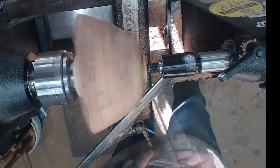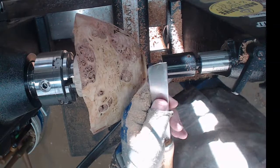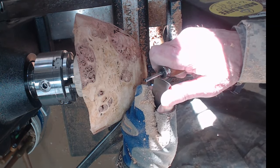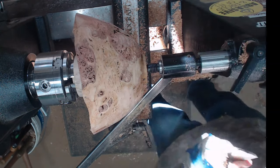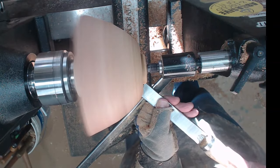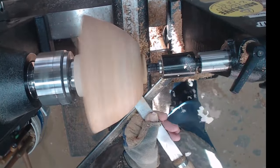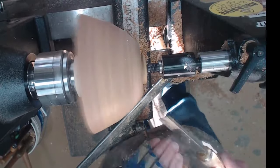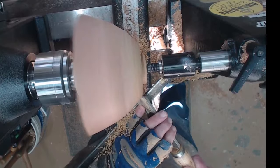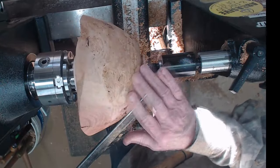I think the burr is gone — let me go back and sharpen it. Lots of techniques for creating a burr: I take the old burr off so I've got two parallel lines meeting in a plane, then I use carbide. Some people use high-speed steel but I think high-speed steel on high-speed steel won't work as well as carbide. I've got this carbide end mill and I just bring it up about three degrees, put a little pressure on it, bring it around — one or two strokes ought to do it. I tilt it down a little bit with very light pressure. Now I bring it up and shear-scrape to get an even finer cut.